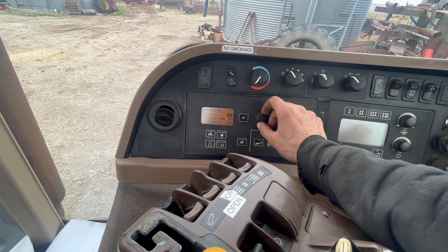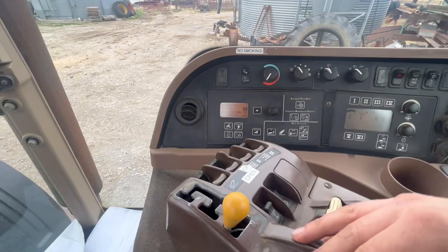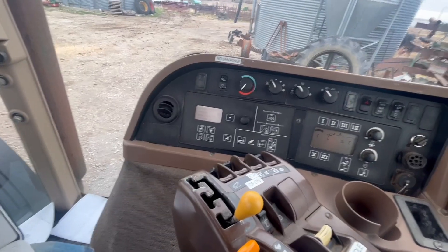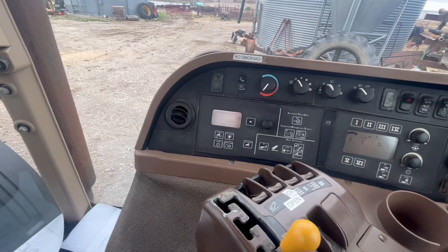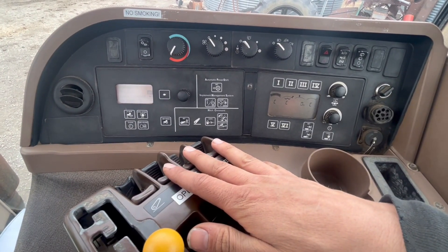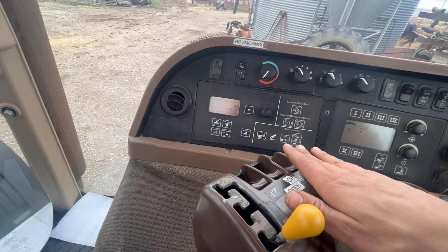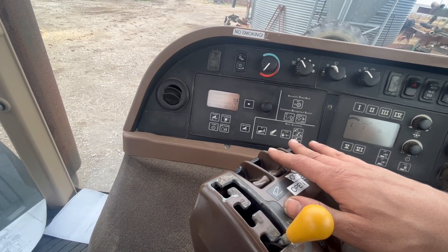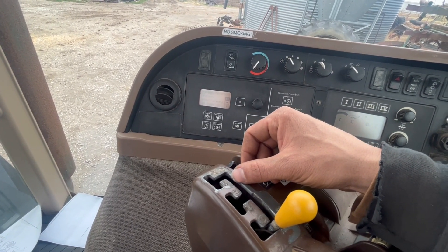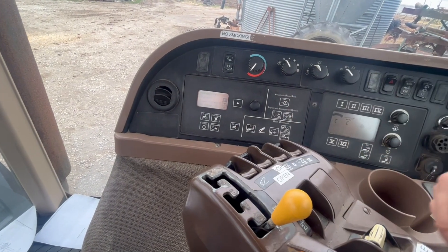It says raise oil temperature — the oil temp is at 52 Celsius. I'm going to use SCV one and set the engine RPM to full throttle. Unlike the 100 series, 10 series, and 20 series, you cannot have any SCVs operating during the calibration process. We'll have to turn them off, and if we need to reheat the oil we'll have to do that after, or just put the lever into neutral and do that.